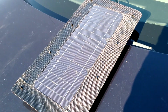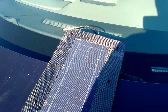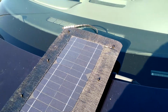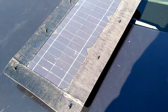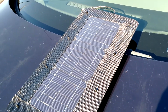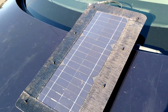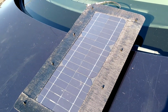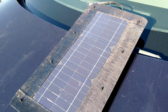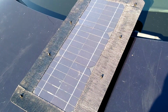So again, this is a prototype. One thing I don't like is it's rather heavy. The supercapacitor bank pushed this thing over 2 pounds. The carbon fiber case doesn't add a whole lot of weight, which is good, but maybe I can make a different version that's lighter, with a smaller supercapacitor bank, because this is a rather large bank. It'll probably last 5 or 10 minutes fully charging something while there's no sun. So that's kind of a long time. Probably use smaller supercapacitors and such.